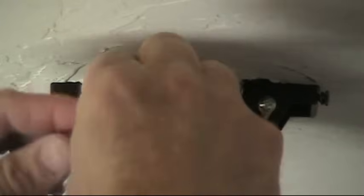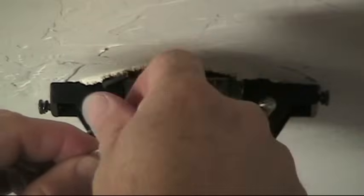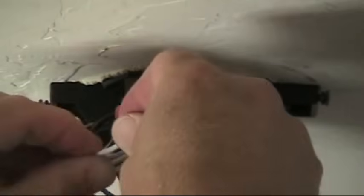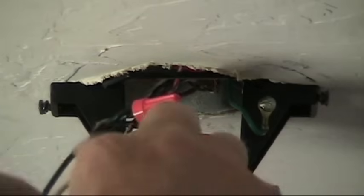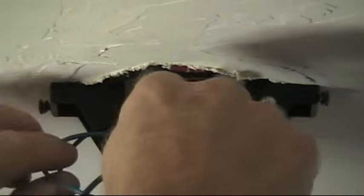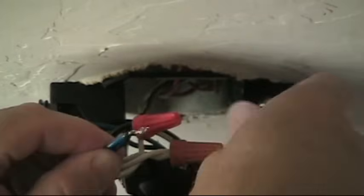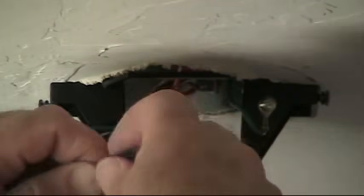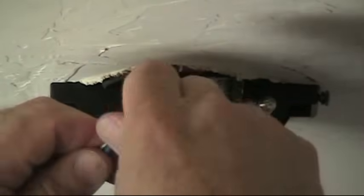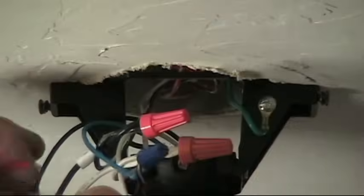We've got some smaller wire nuts here. The common out to the fan — that's the fan and light neutral. They're both stranded wires, so you can spin those together with your fingers, then turn on that smaller wire nut and do the tug test. The black wire with a white stripe coming out of the remote receiver is labeled light out, so that goes to the blue light kit wire heading down to the light kit inside the fan assembly — two stranded wires, twist together and wire nut. And last, the red wire labeled fan out from the remote receiver goes to the black wire in the fan, and that operates the fan.